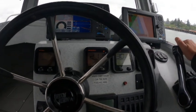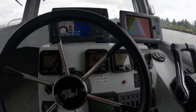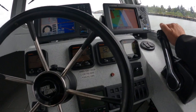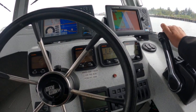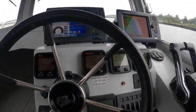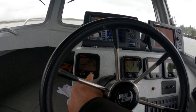Now let's go down to slow speed just to show the front of it and see what you burn. That's going to be about seven miles an hour — keep these lined up, keep your tabs up. 13 — seven miles an hour. Bump that up just a little bit on the tach — there you go. 13, seven miles an hour, two gallons an hour is what that thing's burning.